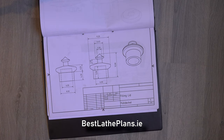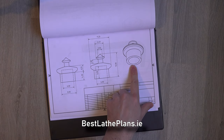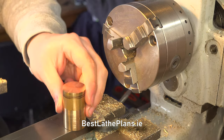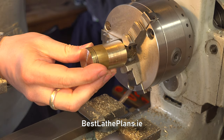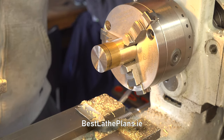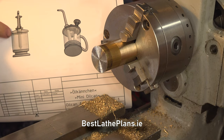Here are the dimensions for the filler cap — all decorative and non-critical except for the step cut, which I'll make to fit into the lid. The stock I'm using is 30mm brass round bar — a small off-cut easily long enough to form the lid. Let's get it mounted securely in the chuck and double-check the plans and the outer diameter.